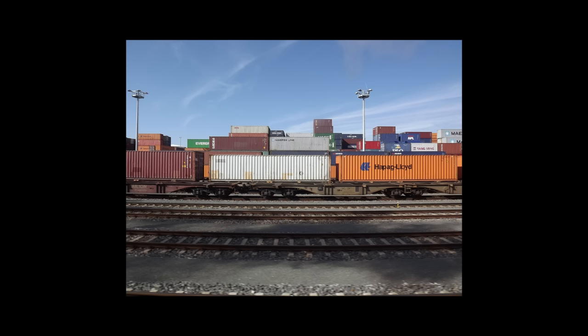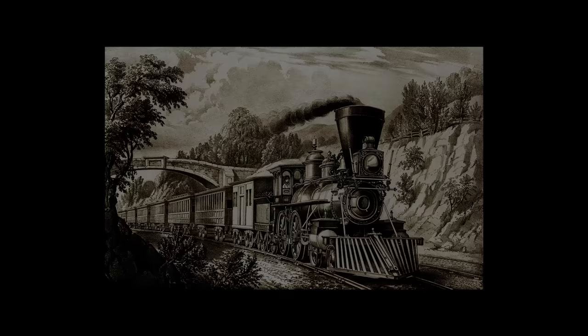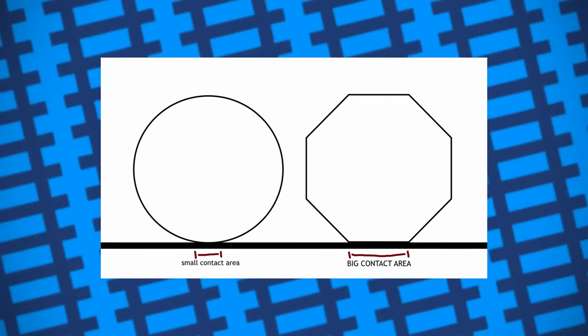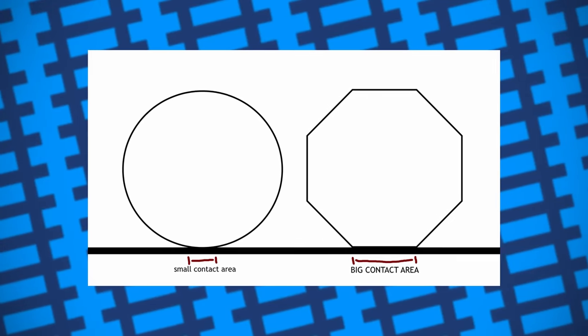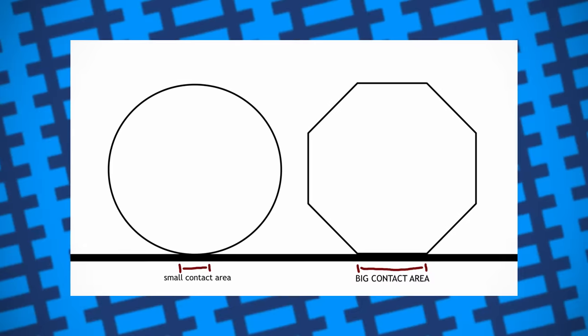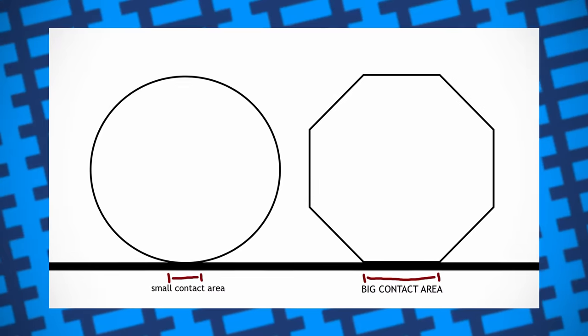Less traction makes it difficult to start moving heavier loads and climb hills. Many designers and engineers wanted to find ways of increasing an engine's traction to improve performance without sacrificing the efficiency of steel on steel, one of them being C.E. Swinerton of the Swinerton Locomotive Driving Wheel Company. His idea was to create a wheel that wasn't round but polygonal, the idea being that because each side of the shape was flat, it would provide more contact between wheel and rail than a circular one, and thus more traction.